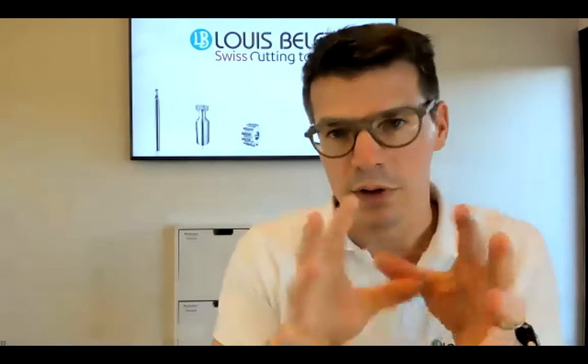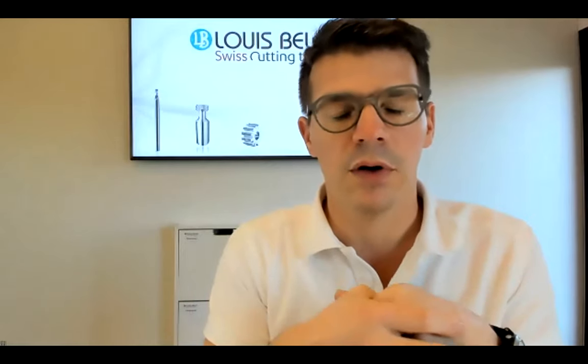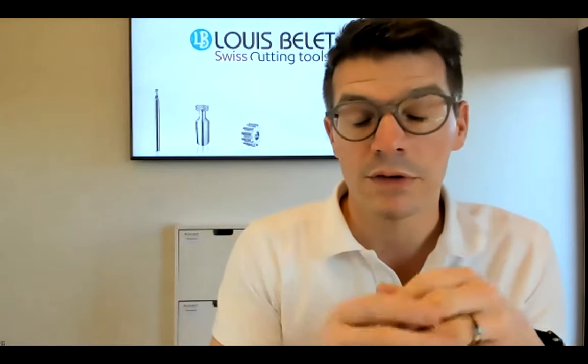So you might know we have two locations now, one here and one 10 kilometers away. All the hob cutting tools are produced in Porrentruy, in an autonomous way. The modules that we produce go from 1 down to 0.01. So it's really tiny, really precise, really small. In terms of DP, for those who use a diametral pitch, it's 25 to 2500. So yeah, it's really fine pitch gears.